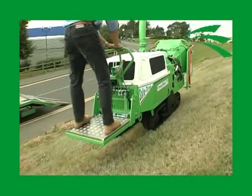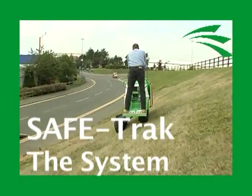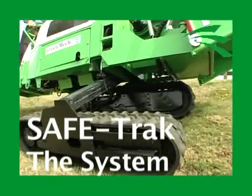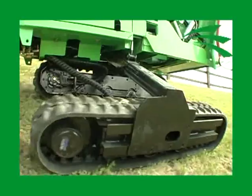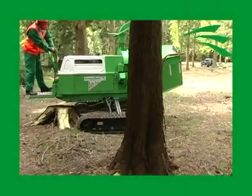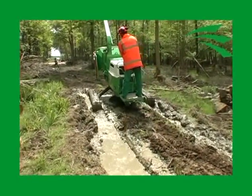Available on all but the CM260, this exceptional design allows GreenMech track machines to get to the worksite without any histrionics. The independently controlled legs allow the machine to be safely tracked across slopes where lesser machines become unsafe. With both legs fully extended, the already impressive ground clearance is further enhanced, allowing the machine to clear stumps, negotiate uneven ground, and wade through water or muddy surfaces.